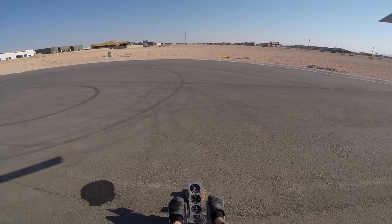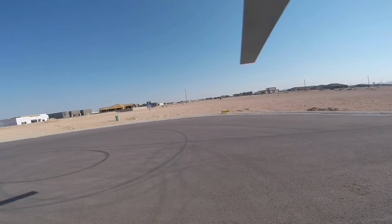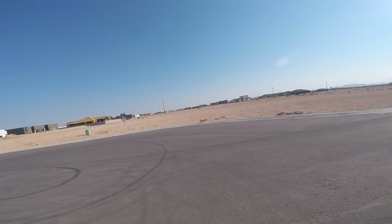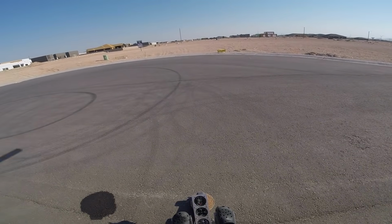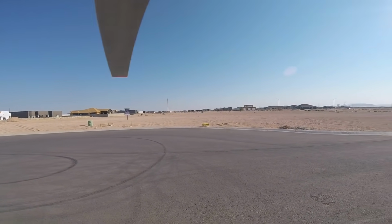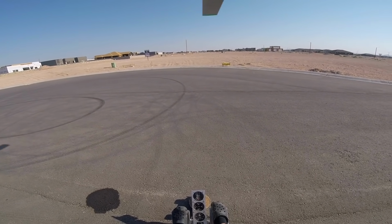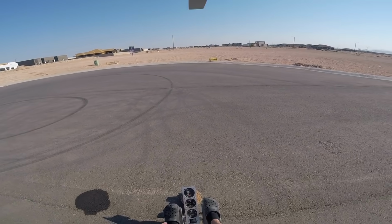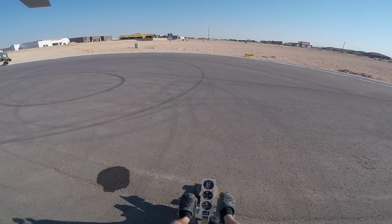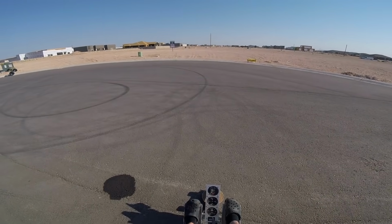So basically, anytime that I'm full throttle on it, the main jet is too rich. I ordered new main jets to correct the issue, and they're supposed to be here in like 2 or 3 days, so that'll solve my problem. I ordered two different sizes. 205s are in there now. I ordered 200s and 195s to bring the EGTs between 1100 and 1200. 1150 would be ideal because it would give me max power, and max power is good, especially when I'm at a density altitude this high.